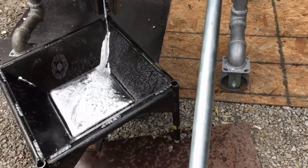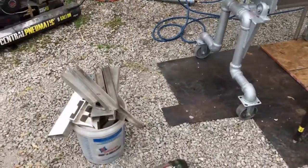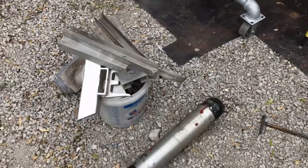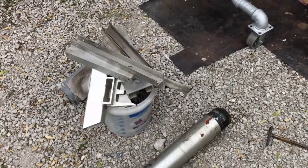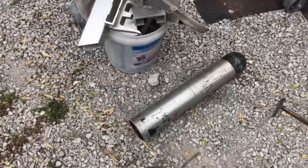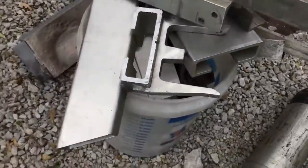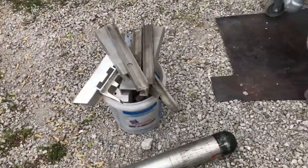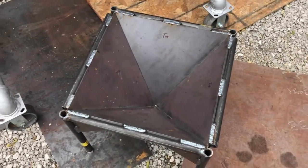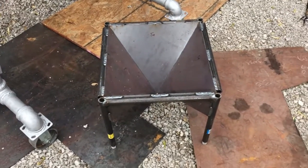The cone molds are doing great — no warping at all. What's up fellas, doing an aluminum melt today. I'm just trying to get a bigger pour capacity out of this thing. The largest volume of metal I have available at the moment is aluminum. I have an oxygen tank that's been cut and some fairly good channel. We're going to be making a big old pyramid cone of aluminum here — I just want to see how this cone mold handles the heat.